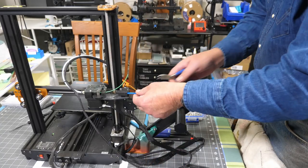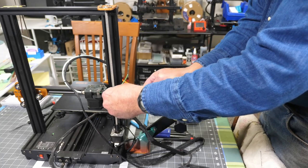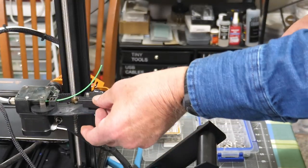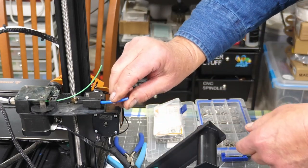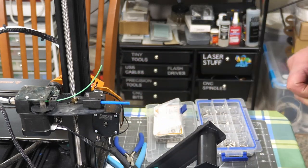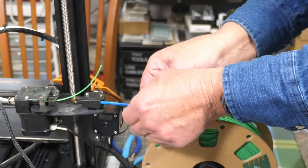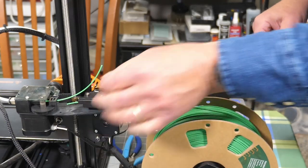Something I noticed on this new sensor is the hole where the filament goes in is actually a little bit bigger. I'm able to get a little piece of PTFE tubing in there, which will help keep this from wearing. This wouldn't have worked too well with the upper feed because going around that sharp angle would have been a problem. I think this is going to work out really well. The filament should feed right through just like so, and that should keep it from wearing.